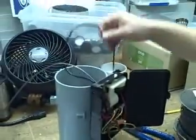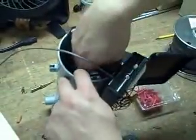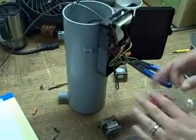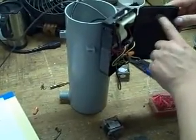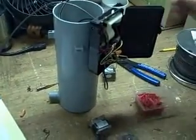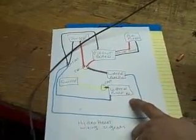But basically, once everything is wired up, you have to test it. You got to test to make sure both water pumps are working. This water pump should be going all the time. You'll hear it go when it's on. And this water pump, when you play with this valve inside, when you pull that valve up, it should turn off. And when you drop the valve, it should turn back on. You have to fully test it before you walk away or else you can't consider it done. When you're done, we're going to have you actually put a sticker in here that says quality control with your name. So please be careful with this. Again, just follow this diagram, which will become very easy after doing it a few times, and you'll be all set.